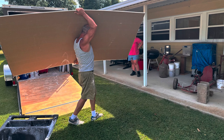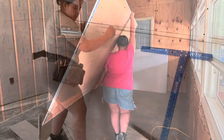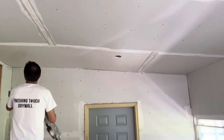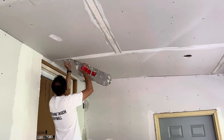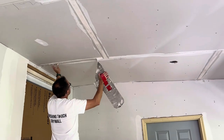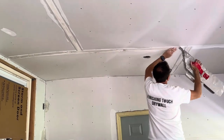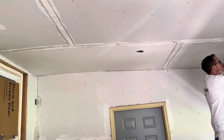Here you can see we are gearing up and stocking the job to get ready to do some finishing on a porch converted to a sunroom. Our new team member is progressing nicely — already carrying sheetrock by herself and doing some cuts on rock using a little T-square. Here we are starting the taping process with the banjo, just zipping up the job. I'll have to revisit some before and afters and durings once the job is complete.